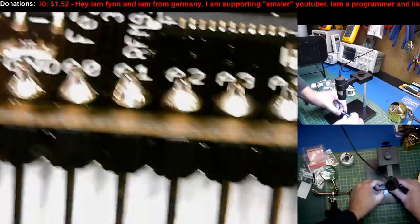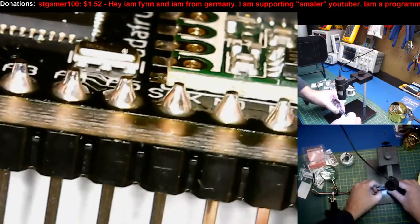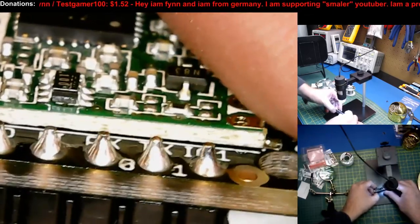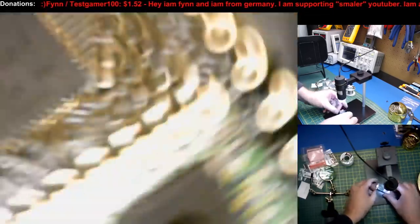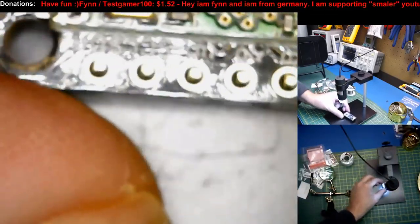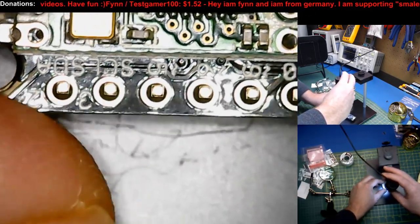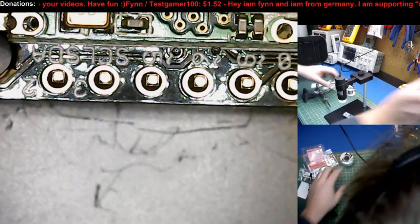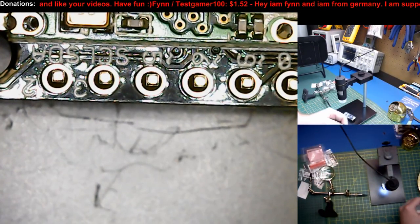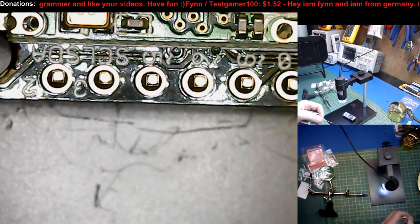You're aiming for nice and shiny — not this ugly pastel look. Nice and shiny is what we got. We can go ahead and do the other side. Take some time and make sure your solder joints are good — it truly matters, because bad habits on this last a lifetime. I've seen way too many bad soldering tutorials.